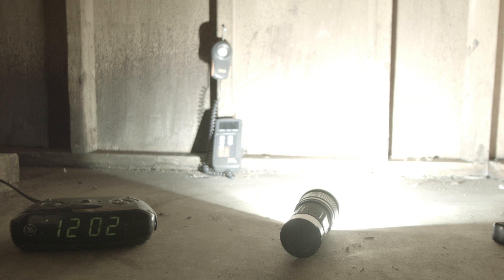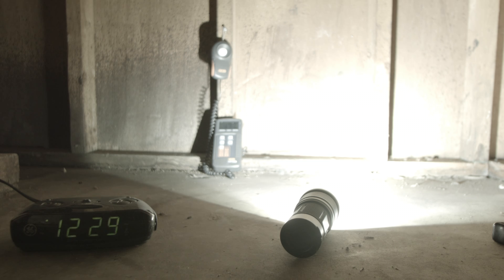Now high mode. High over the first 10 minutes is about a 10% drop in brightness. It drops in brightness over the run time, and at about 1 hour in we have a 42% overall drop in brightness. The light cuts off at 1 hour and 22 minutes at 45% of its initial brightness. I'm pretty surprised that both high and turbo sustain modes this high without dropping much further — almost to the point where I don't trust my lux meter or my testing method.